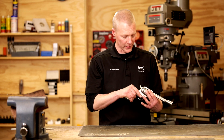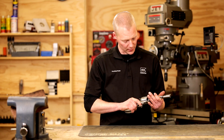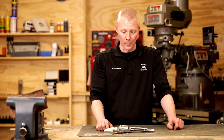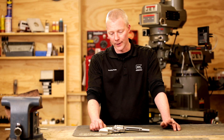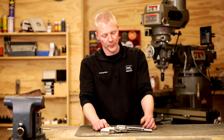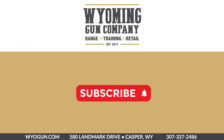Looks like she works great. We're back in the shop at the bench — the test fire went really well. The trigger feels amazing: super light, super crisp. I think the customer will be really happy with this. This is just one example of a trigger job I can do. Most bolt action rifles, semi-autos, almost every revolver — Smith & Wessons, Colts, 1911s — pretty much there's something you can do to improve the trigger on almost any gun. They all vary in design a little bit, but it's kind of the same concept: it's either a matter of honing the surfaces, smoothing things out, and putting lighter springs in, or a combination of all that. Don't hesitate to get a hold of me if you're interested in this kind of service. Don't forget to like, give us a comment, subscribe to the channel, and hit that bell notification. Thanks for watching.